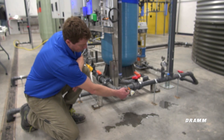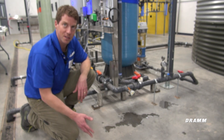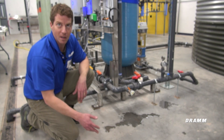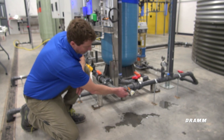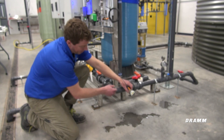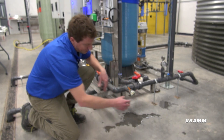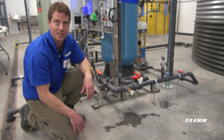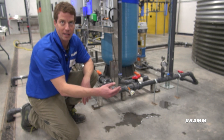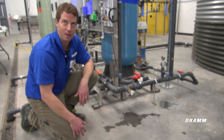This sensor is a stainless steel probe that goes into the pipe. It needs to be cleaned on a regular basis — it doesn't need to be recalibrated. You should check it every three months at the very least. When you pull it out, you hold a nut that's fitted into the pipe with a wrench and disconnect the compression nut with another wrench. You can pull the entire sensor out and clean it with something like CLR, removing any calcium or mineral buildup on the stainless steel sensor.